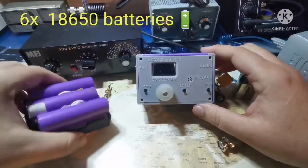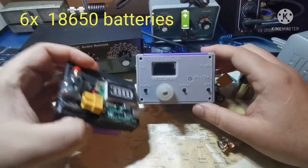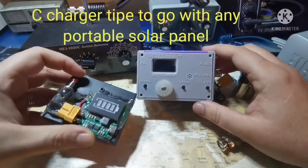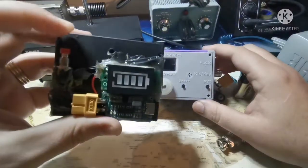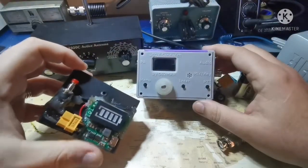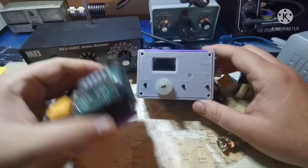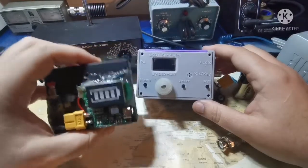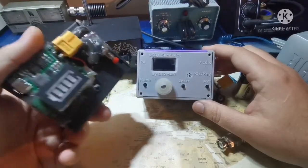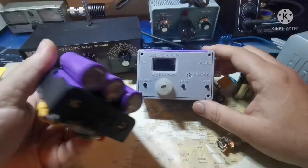I'm using this as a battery pack — it's double battery packs of the lithium polymer type, with a USB-C charger for the batteries and a battery monitor to check charge level. It has decoupling security so it won't overcharge and won't go under the minimum charge. I built this for about 10 euros and got the batteries from an old laptop.